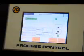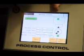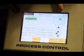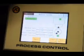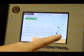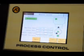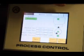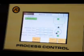Right now it's running. We're going to go into manual mode. As you can see up here, as each hopper is being put into the mix chamber, or pardon me, the weigh hopper, it's showing you which hopper is feeding that location. And you'll see that it's going to cycle through. We're right at the end of the batch here on C. Right now the weigh hopper is opening up, dumping in the mixer. Currently we're operating. Now we started another batch. Hopper A, now hopper B. As you can see, we're going pretty fast through the different ingredients for this batch.